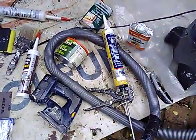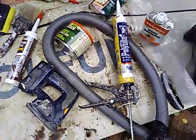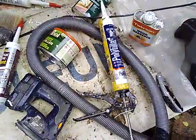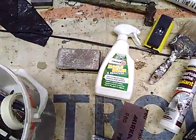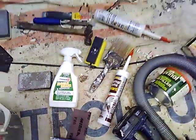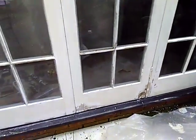Here's a big crack — I'll clean all that out and then shoot some Polyfilla in there. This is indoor and outdoor Polyfilla — I use this most of the time. I could buy cheaper versions but I can't see the point. After I cleaned everything off yesterday I sprayed it with the Zinsser mold killer and remover because I could see green in there. I was hoping to see better results this morning but it still seems to be there — I know I've done my best at treating it.